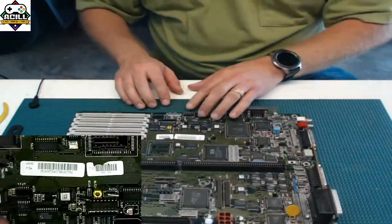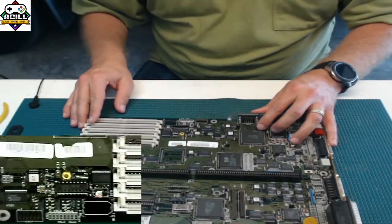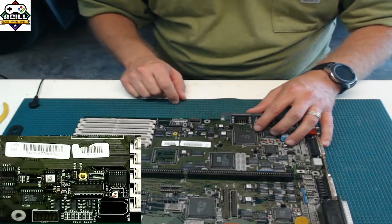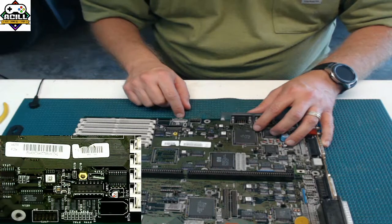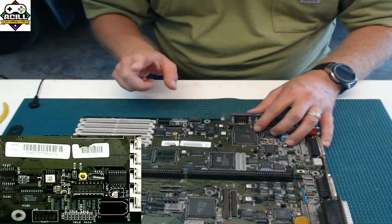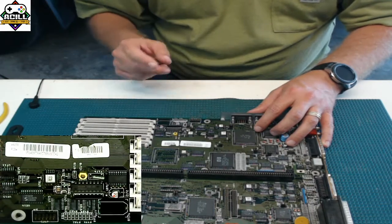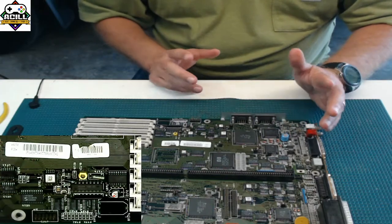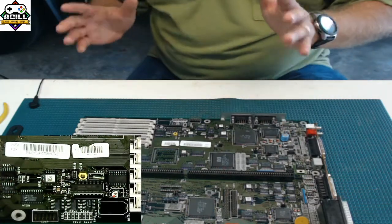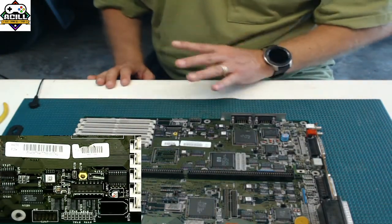And again, we're going to use this section of the board again in here, because this is a section on 4000s that commonly leaks, and it's a section where most damage is done because of this stupid Varta that's right here. And we're going to go ahead and remove these three chips. Actually, I'm just going to remove this one for now. We're going to remove this chip, clean it up, and put it back on. And when we put it on, I'm going to use two different techniques that I'm going to show you. One is point-to-point soldering, and the other is drag soldering. One takes a little more skill than the other, and they use different style tips, but they're very easy to do, and you're going to see here just how easy it is and why I think surface mount is much easier than through-hole.